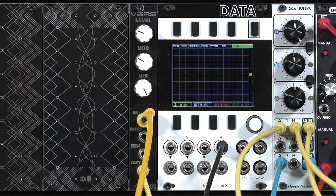As I mentioned in the first movie, this particular reverb module uses a trio of digital delays. This is an old technique to create a reverb effect. In this way, it's kind of using a tuned delay line to create a resonator, which is a popular technique these days in modular synthesis. In the verb module, changing the mod control changes the timing of those delay lines, which, depending on what note you're playing, results in different harmonics being added and subtracted.